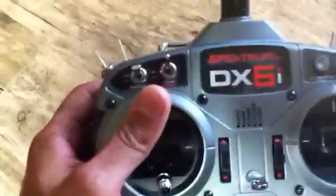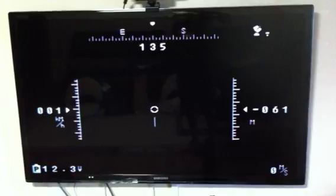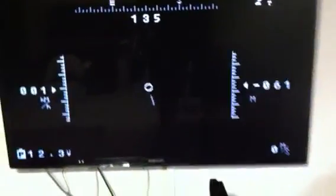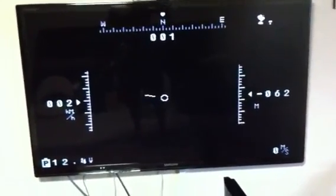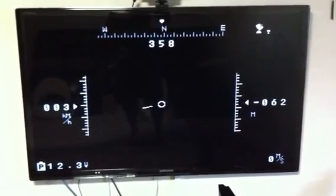Personally, I did also another setup here. I put the lights on the gear button, and I also put the screen display mode on. So this is a way to make good use of the channel. What I did was put a wire harness before the screen mode and before the lights — you connect it to channel 5 for the lights and screen mode, and to channel 6, which is supposed to be the flaps.